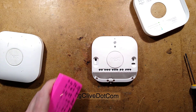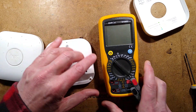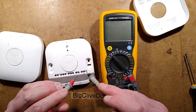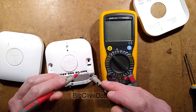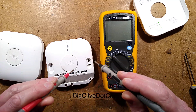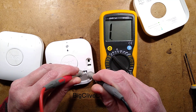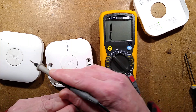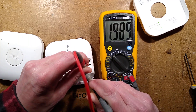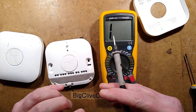There is another test that can be done. If we bring in a meter set to diode and continuity, the 12-volt supply here that feeds the remote thermostat appears to be basically connected directly to the 12-volt bus. If we put it around one way, normally we'd get a diode one way and the sign of a capacitor charging. But in this one, we're just getting a dead short circuit in either way around in those connections — that suggests the 12 volt is dead.